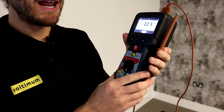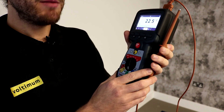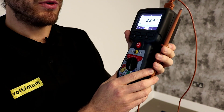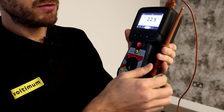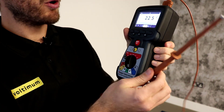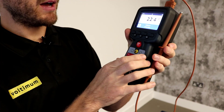The temperature compensation allows correct IR measurement for variations of temperature, which enables trending of IR measurements with confidence over long periods of time. We select our temperature setting using our type-T thermocouple lead — 22.5 degrees — and we save that.